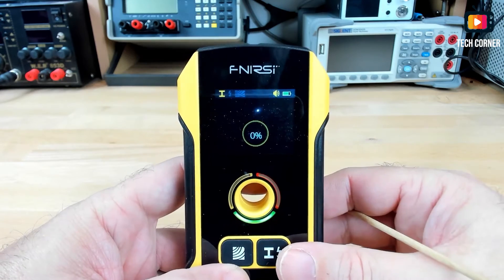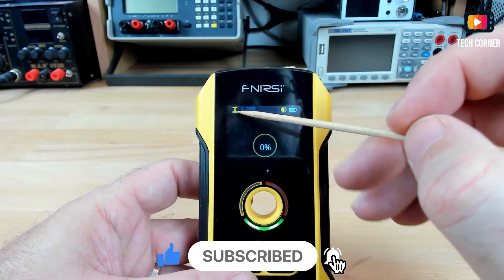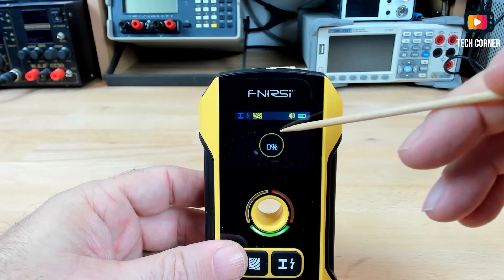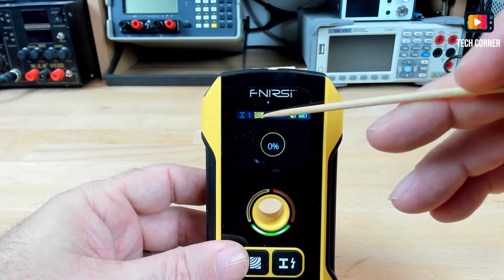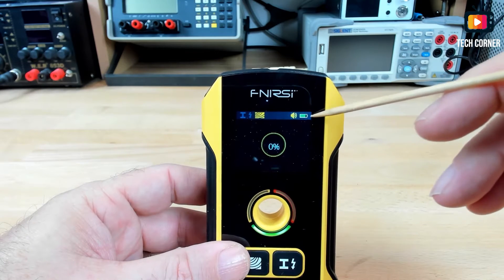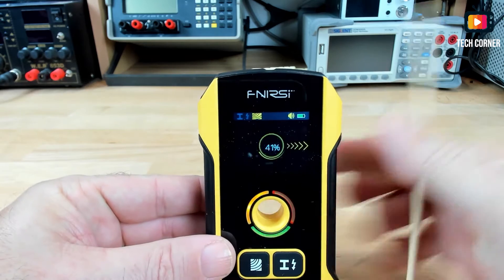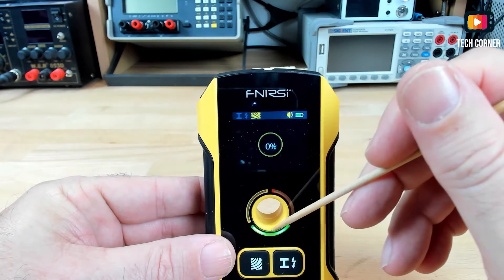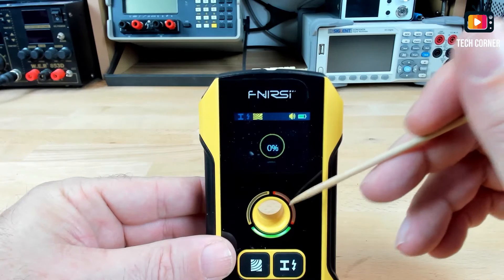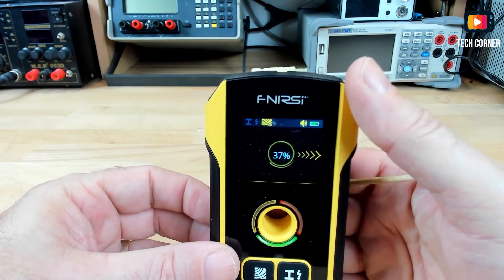In terms of the screen, we have several pieces of information. Right now we are in metal detection — you can change mode but it needs to calibrate on the wall. In wood detection mode, for example for studs, we also have the sound icon and battery charge shown. When you move left or right it shows where the center is — the lights turn green when you are not near the stud, yellow when you are getting close, and red when you are directly over the stud, electric wire, or other material. It also tells you the depth from the surface.